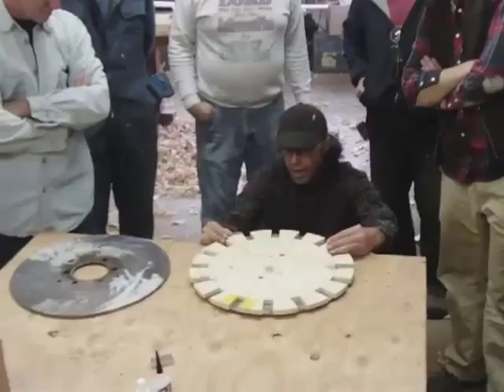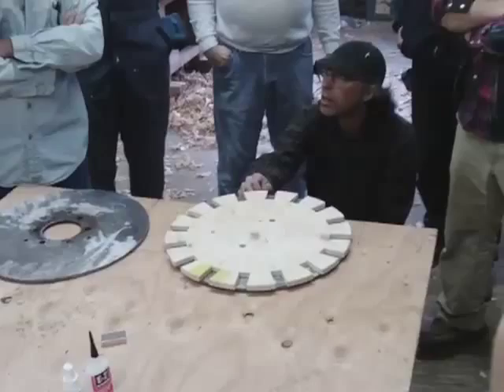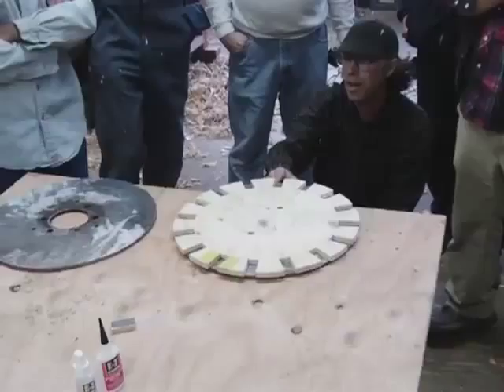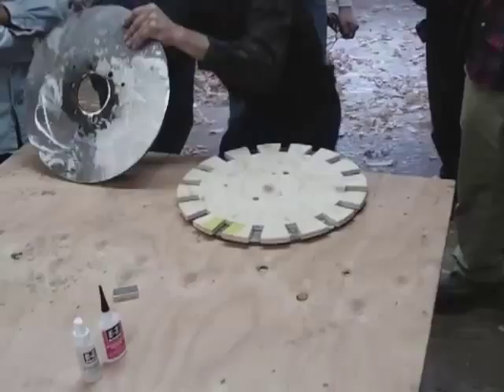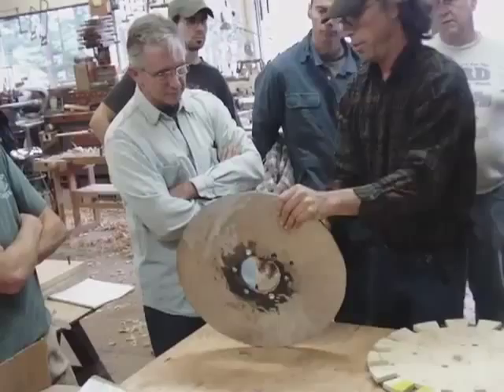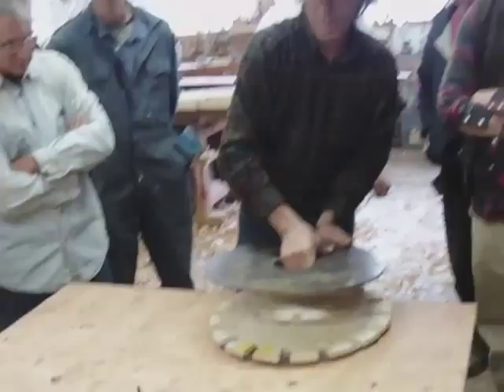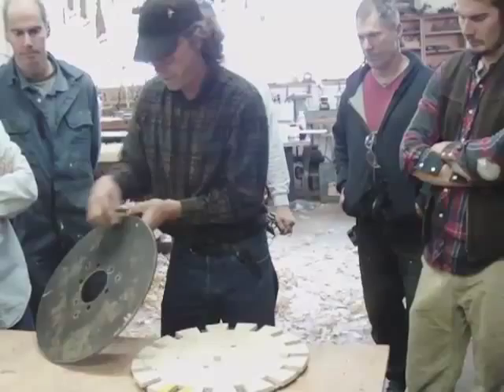And then I marked it with a sharpie here. There are blue lines there, and that means that this magnet lives here. There's also a corresponding mark on this one here, so a magnet's going to live in between. This is the front rotor because it's been tapped, and the ground surface would be inside where the magnet's gone. So we piled this whole thing up, pinned it together, made those marks so we know where a magnet lives. And then on each rotor, we drew an index marker, so that hopefully a hundred years down the road this thing's going to come back together.